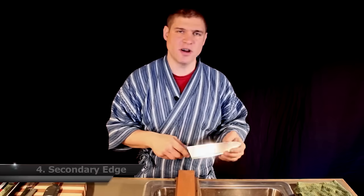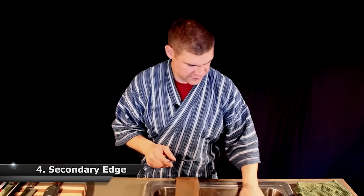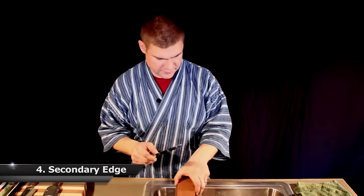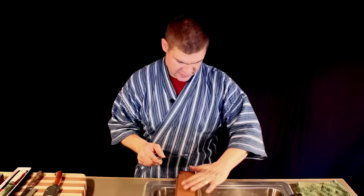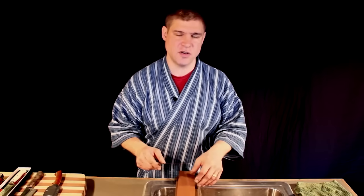That brings us to step 4, which is the actual grinding, or the blade thickness adjustment. I'm going to take the rougher of my 2-stone set. Basically, if you're going to use stones to sharpen, you need one stone that's rough and one that's finer. We'll talk more about those details later. These happen to be a 1,000 grit and a 6,000 grit stone, but you could use an 800 and a 2,000.